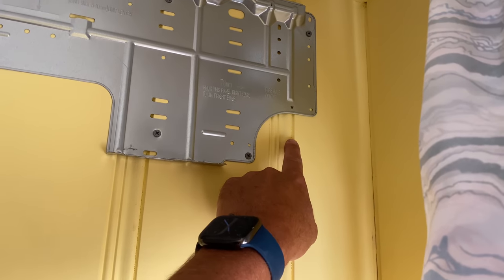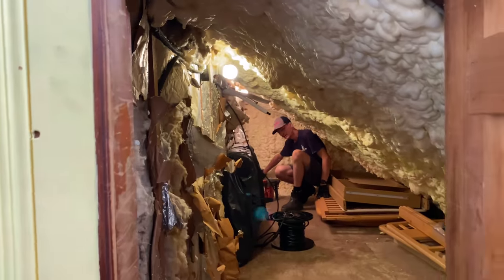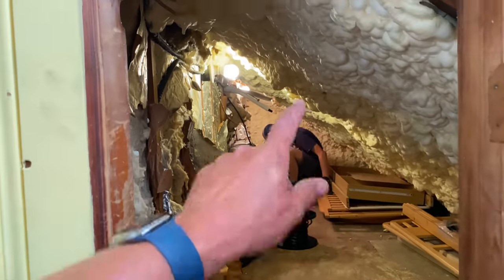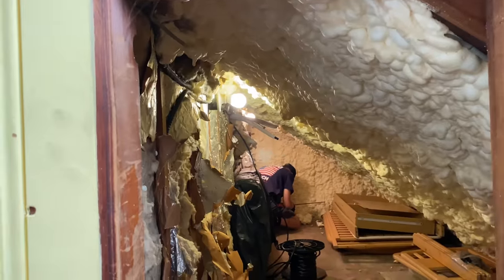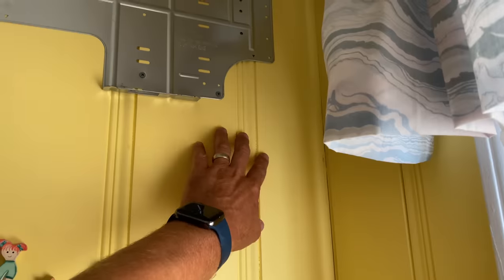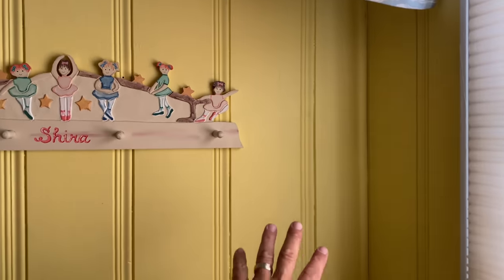We're not drilling a hole there — that would not have been cool, we wouldn't drill through the side of the house. We have the roofline right there, and the other line set connections coming out of the wall. We'll go a little bit lower if possible to let gravity take effect. For this small room a 7,000 BTU unit will go straight down into the knee wall — they can paint the line set covers yellow if they want.